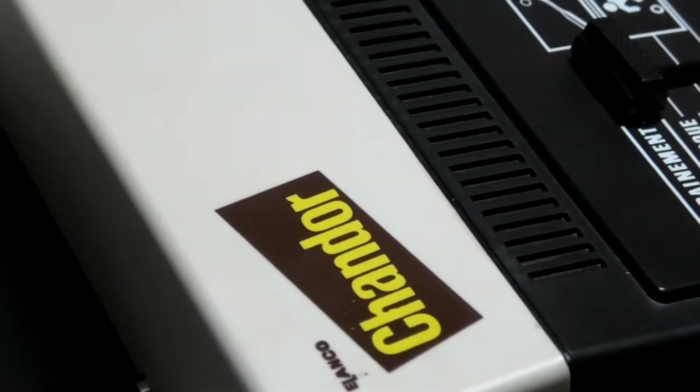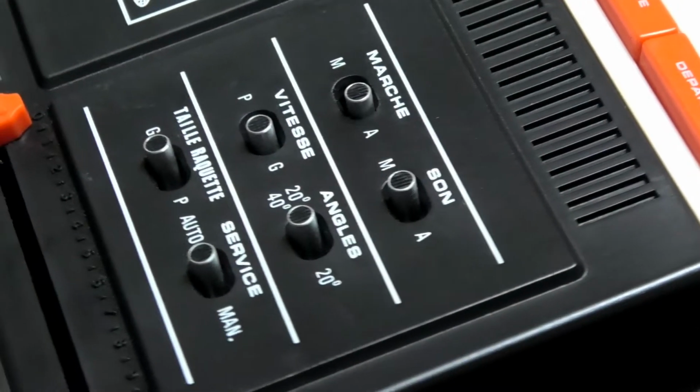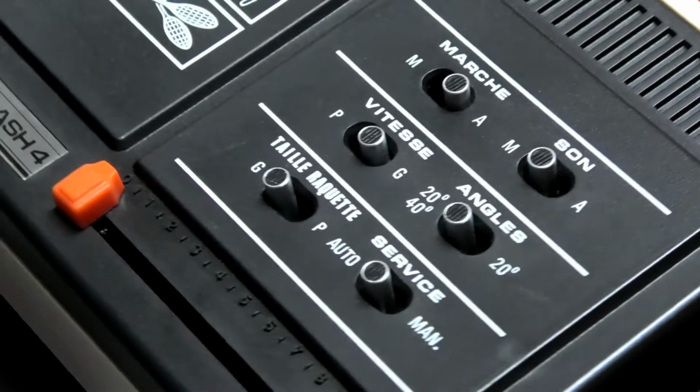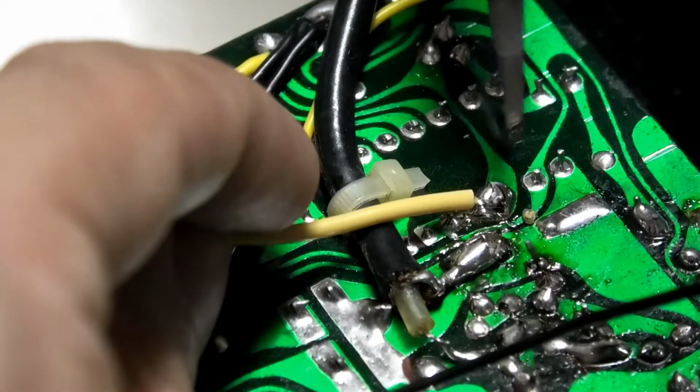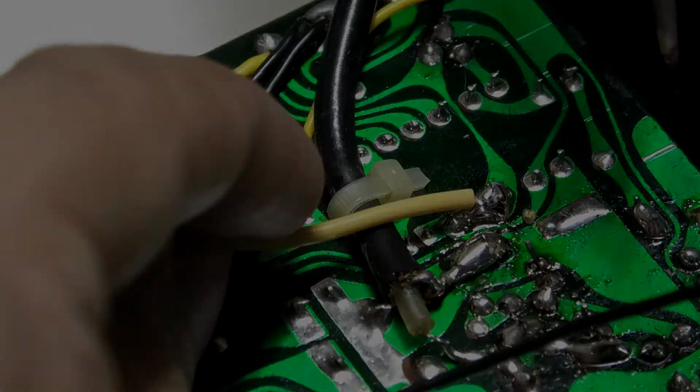RF signals are rubbish, but I can usually get good results with it for what it's worth. That's not the case with this system, a French clone of a German PONG clone. It's a shaky, snowy mess, and I'm getting tired of trying to fix it, so we're going to try and drastically improve it with the composite video mod instead.